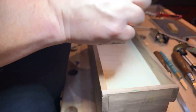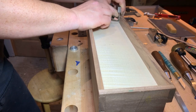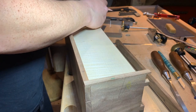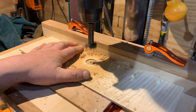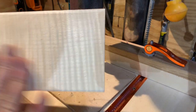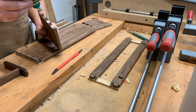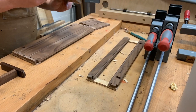I had to mark out pretty accurately the centre point for a shaft that's going to be going perpendicular through the top and the bottom surfaces — to activate it, you'll see that later, but it needs to be right. Here I'm marking out where my mortises are going to be for the tenons I've already cut. The top and the bottom are veneered panels, but drilling through them I didn't want any breakout, so I carefully go through from either side, nice and slowly. And it's time for everyone's favourite part — gluing up. That could go wrong really quickly, so best thing: dry fit first, and don't be afraid to ask for help.